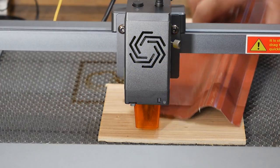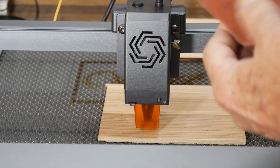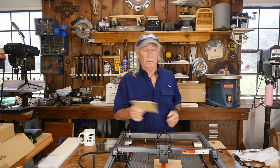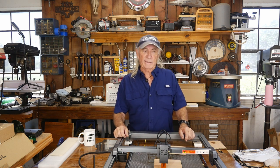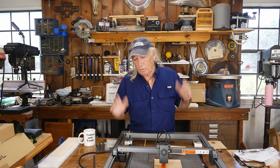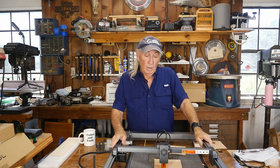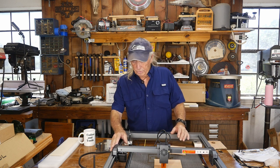Let's see if we can cut through with 10 passes at high speed — it's hot but it's not through. Quick recap: 3/16" plywood — no problem. 14-gauge metal siding — no. I went around several tries and it just can't do it. There's just no point — you'd need to go get a circle cutter. Would have been cool if it cut through, but you'd need a lot more power than 10 watts of diode laser.